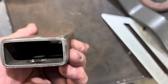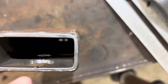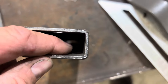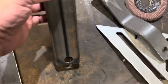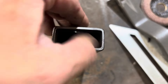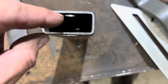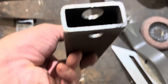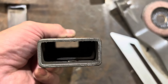I want to show you a little tech tip real quick. If you look down inside this metal, you can see where they welded it together at the factory - there's always a little bump there from being welded. That's why I chose to drill this side out, because I wanted this side to be the flat side that I clamped up to the piece right here. So just be aware of that on the middle or the inside - there's always a little lip or nub there from them welding it together.